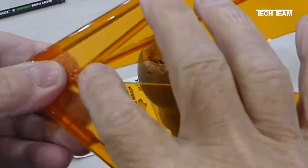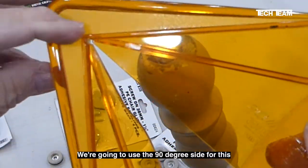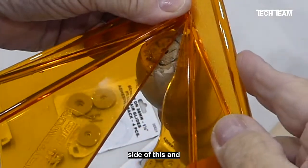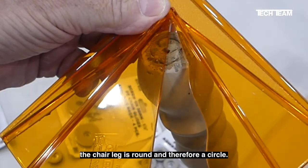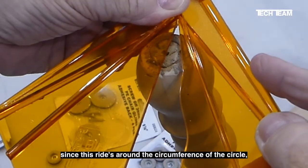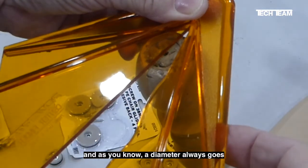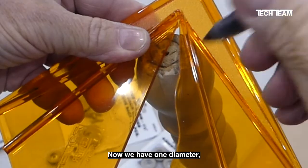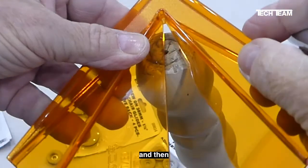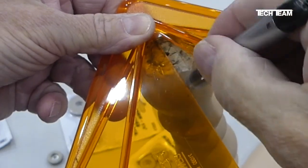This clever little device has two ribs on one side at a 45 degree angle and two on the other at a 90 degree angle. We're going to use the 90 degree side for this example. Since the chair leg is round and therefore a circle, when we put this on there, it rides around the circumference of the circle and this particular line always forms a diameter. As you know, a diameter always goes through the center of the circle. Now we have one diameter — we draw a line through it — then we rotate this a little bit so that we have another diameter and draw a line through that.